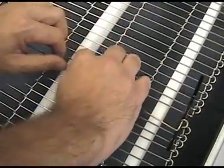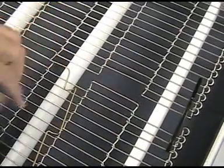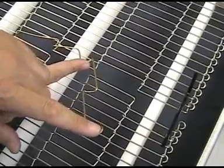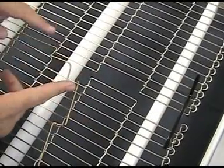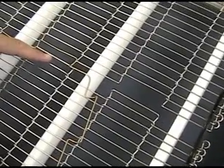Now bend one end of the wire up and thread it around the Z-bend of the next space of the wire, in the joint end closest to you. It is important that you never bend the wire at a Z-bend point. This will weaken the strand and make your splice fail prematurely.